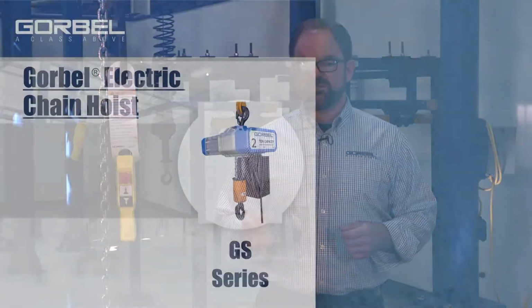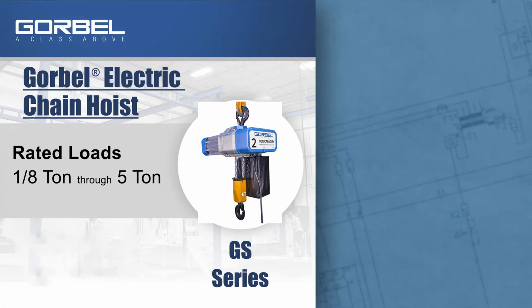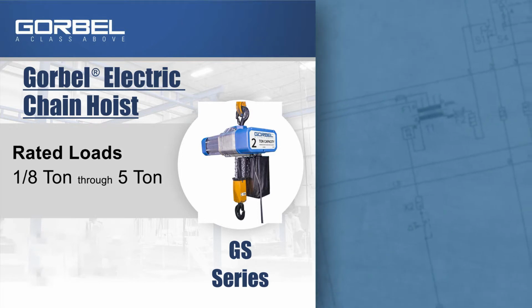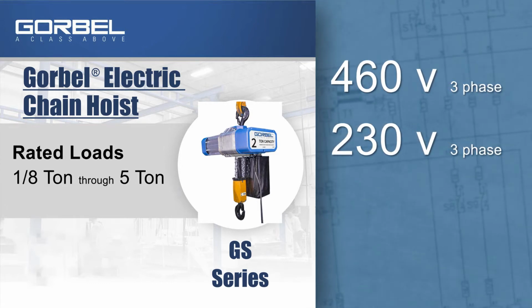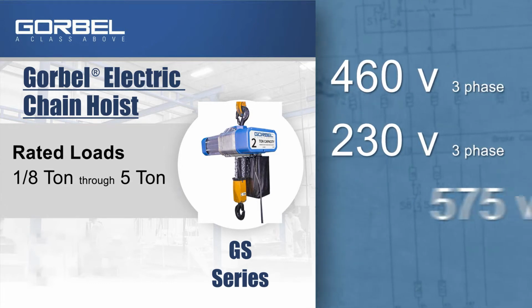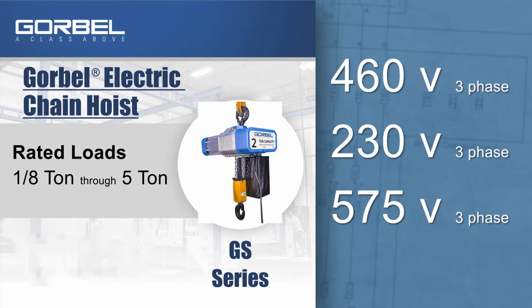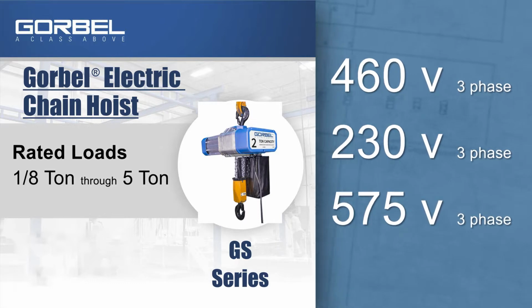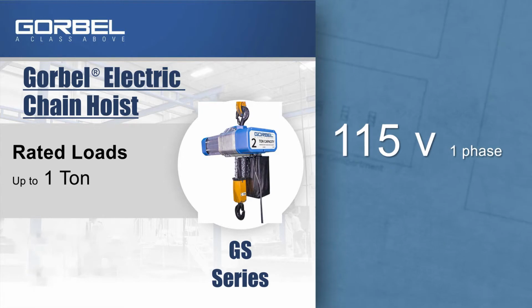The GS Hoist is available from Gorbel in 1/8 ton all the way up to 5 tons. The entire product range is 460 volt or 230 volt, 3-phase. We also have a small offering of 575 volt 3-phase hoist for the Canadian market. And on the lower end, up to 1 ton, we have a 115 volt single phase offering. We also have manual and push trolleys and all the accessories that go with the electric chain hoist.